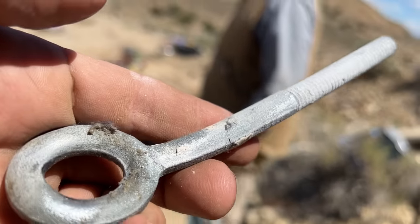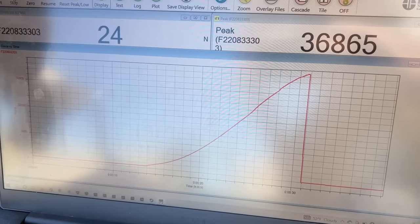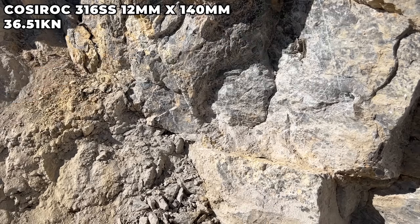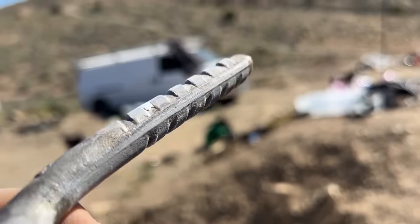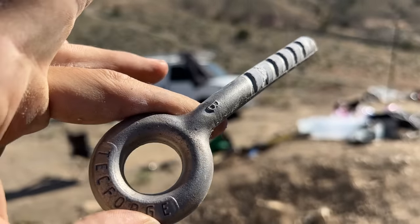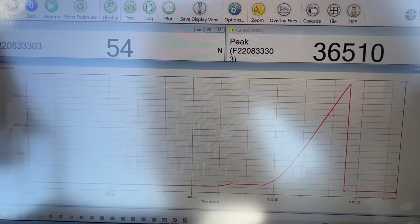The threads on this aren't really thick — more of an oval shape — and some of the rock spalled. 36.87 kilonewtons. It didn't deform much; the grooves just aren't ideal. This is the stainless steel version. The galvanized engages more with the glue, but 36.1 kilonewtons — that eye is not going to break before the glue.